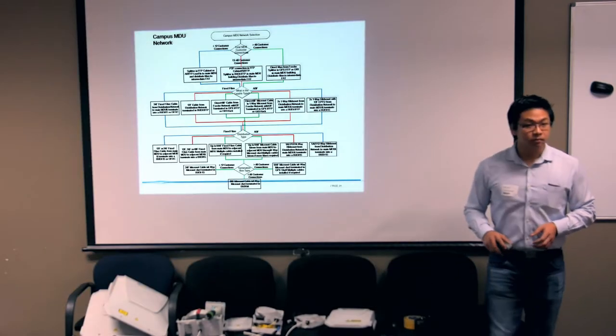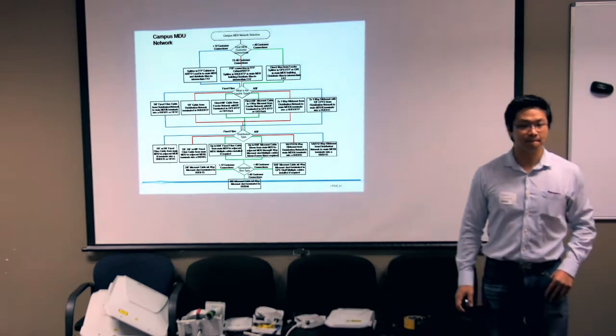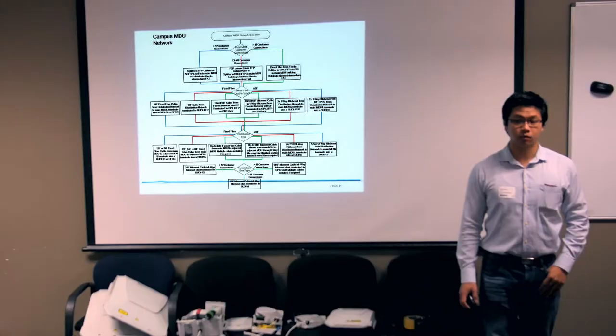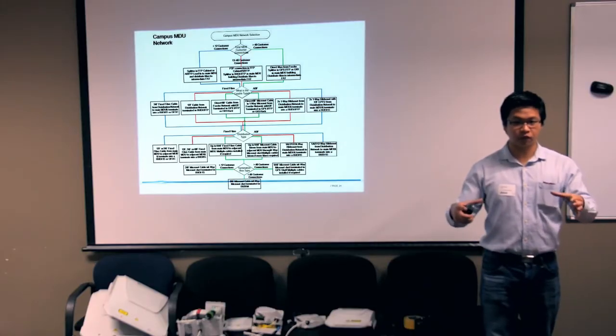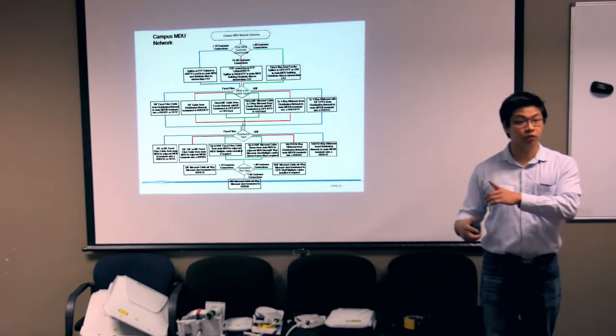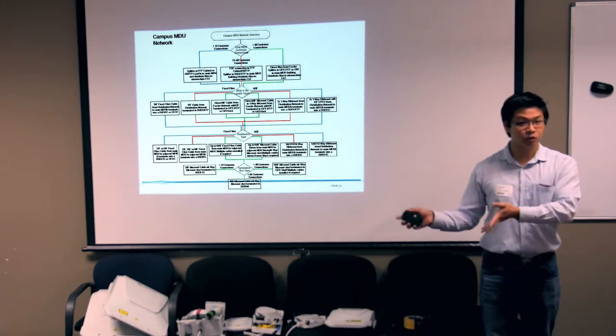If you have a scenario where you've got a 100 millimeter core hole going from one fire cell to another fire cell with existing services in it, we'd be better off doing a separate penetration and fire stopping our own, rather than trying to fire stop this existing 100 mil penetration. Well, if that 100 mil penetration is already open, it's actually cheaper for us to just install through it if the building owner agrees, and then get them to do the fire stopping.